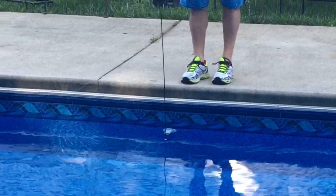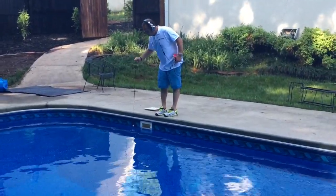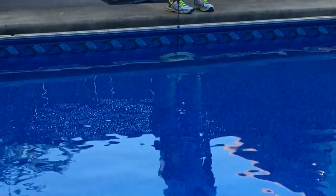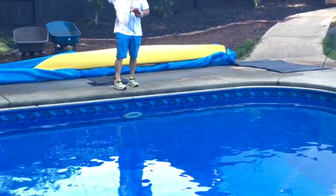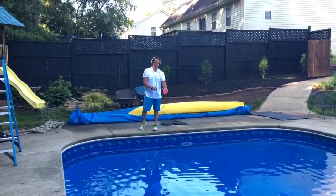I like to listen around returns, just in case they are grounded — we're just going to rule all this stuff out. We're going to listen to lights as well. Then we drop and drag the Pool Scope over our main drain, let it set, and pull it right up on the drain. Those leaks are really loud, typically. We're not hearing anything, so we rule out all those areas just by listening with the Pool Scope.